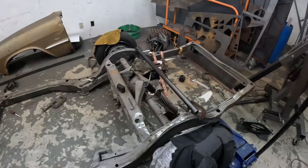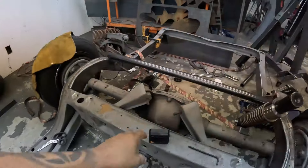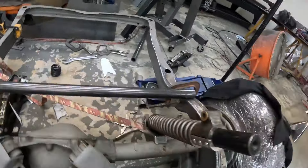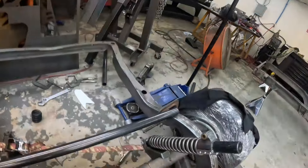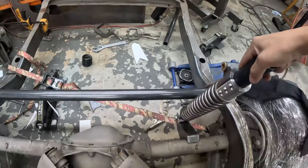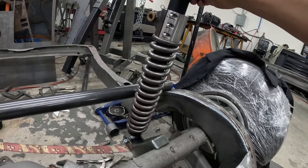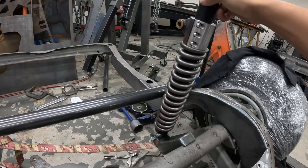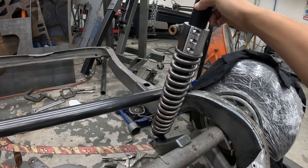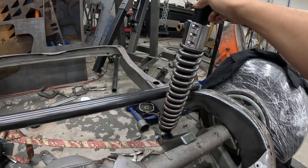My game plan is to remove the axle, tack weld the lower brackets on, and put it on the table. I measured my pinion angle how it sits right now, so once I put it on the table I can match that pinion angle and weld on these brackets so they're parallel with the ground — that's the way I designed the brackets to be. The bar definitely needs to go back because I want to give it a slight forward pitch, but not a crazy pitch. When the car raises up the cylinder is going to try to go backwards, so I want to keep the cylinder as straight as possible throughout the whole cycle. I'll give it a slight forward pitch, then measure where to put the bar and see what clearance I have, and from there make the upper bracket.